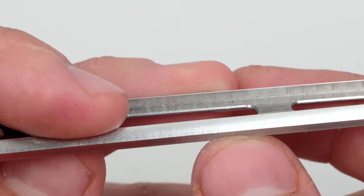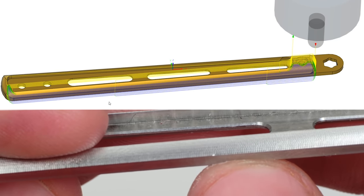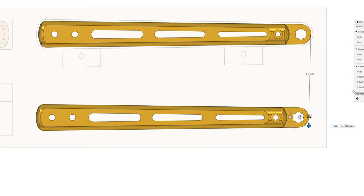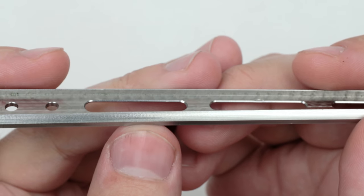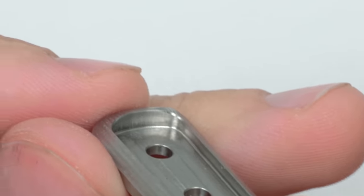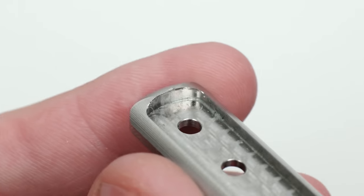But I don't like these little bumps where Fusion thinks it can stop the toolpath. So I copied the surface and extended it a bit. I also tried shifting things over even more, but still no luck with the chamfer. Looking at the original again, the rest of the deburring was fine — it even went all the way around this complex edge. But now it's too big on one side and there's a burr on the other.